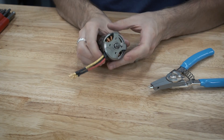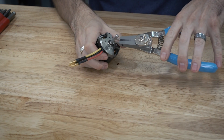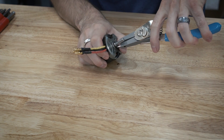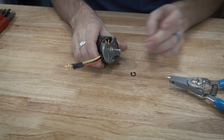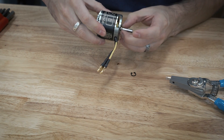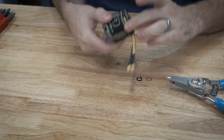The first step to taking this motor apart is to remove the snap ring. I'm going to remove the snap ring with some pliers here. And after you get that off, there's a little brush washer that you want to get out of there as well. It will kind of bind up if you try and take this apart.